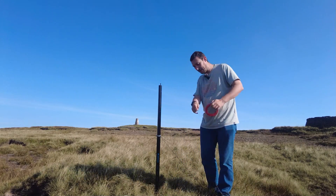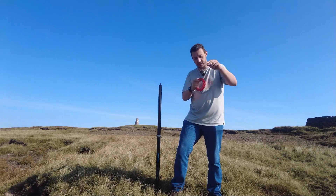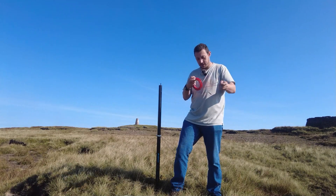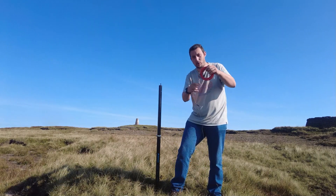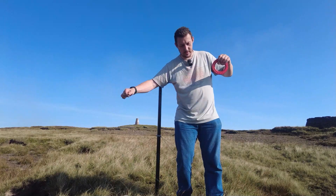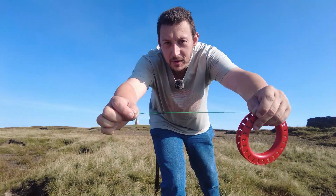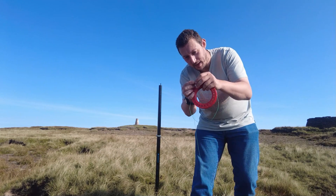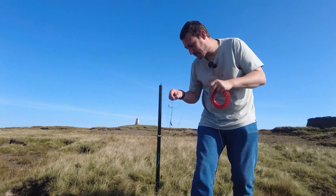Slide that down - you can see how that's going to guide the mast. So I've now got my mast guided out in three directions. I've got my half-wave piece of wire here - these are kite reels by the way, just an easy way of wrapping up the antenna and keeping it neat in my bag. I've got some guy string on the end, and a bit of aquarium tube - you'll see where that comes in. What I've done is reel this out until I get to a little bit of black electrical tape - that's so I know where the top of the mast is. That's where it bends off to make the L, so this section is the vertical and the rest is the horizontal.